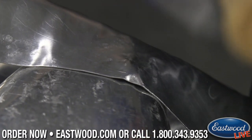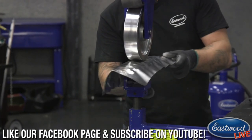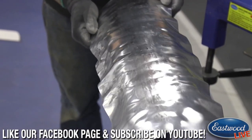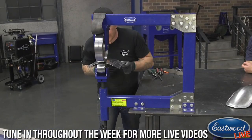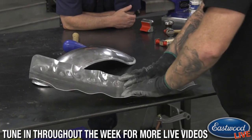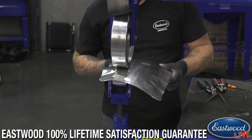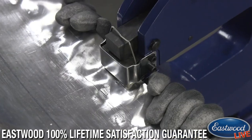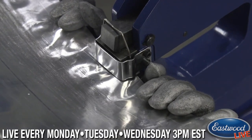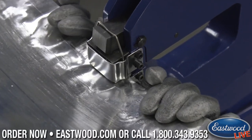And then after that, we put it in the shrinker stretcher. So that's just me finishing it. And I smoothed it a little bit in the English wheel just to get the piece under control a little bit. And you can see it's starting to come in there, getting a little smoother, just so I could check my shape as we were going. And rolling it in the wheel a little more. And then the shrinker stretcher. So I put it in the shrinker stretcher to pull in some of the smaller tucks and also show you guys a little bit of the process.